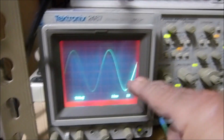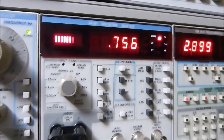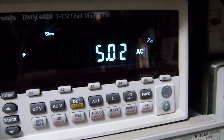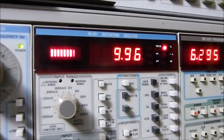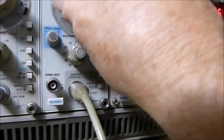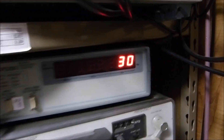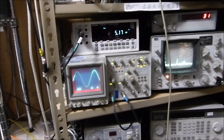This unit is self-scaling. With negative feedback — the 5-to-1 power ratio, which is about 7 dB — it still looks good. We drop to 1 watt at 20 Hz and THD is 0.7%. Running back up to 5 watts there's a little wrinkle and THD is a bit higher. At 30 Hz it looks pretty good — a little over 1% THD; performs really quite well.